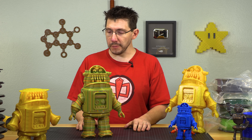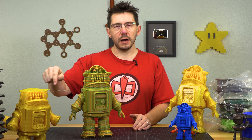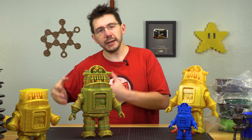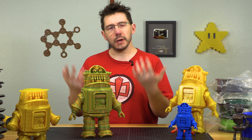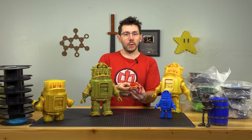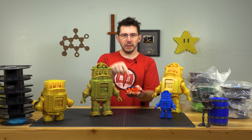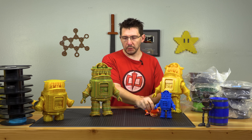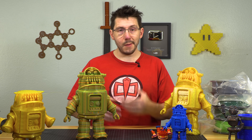That was a lot of fun. We showcased a really cool model from Fab365 — a $5 download that delivered $5 worth of enjoyment. We learned that a possibly corrupt SD card can cause a printer to do strange things, because G-code is plain text and corruption can garble it, causing the printer to dive into the print or spit out filament. We also showed how changing filaments makes for a colorful robot, demonstrated on the Raise3D N2 Plus and the GMax using the Palette Plus.